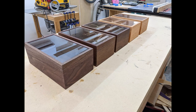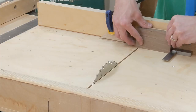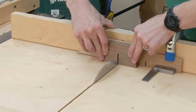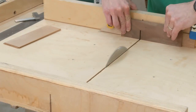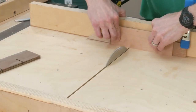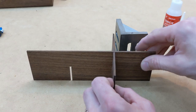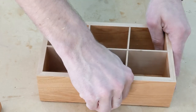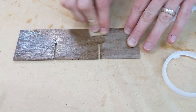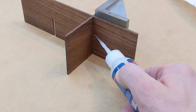With the exterior of the boxes complete, the next step is to make the dividers. The stock is milled down to the thickness of my table saw blade kerf and cross cut to final dimension. With the blade set to half the height of the divider stock, the short segments get a single cut in the center of their length, while the long segments get cuts one third of the way in from each end. These pieces fit together in a grid as a friction fit into the box. After the divider parts are finished, a small dab of CA glue is used to hold the pieces square.